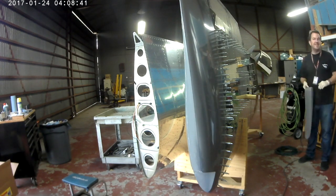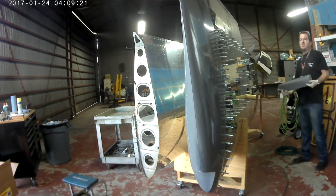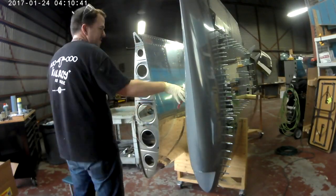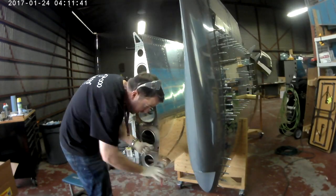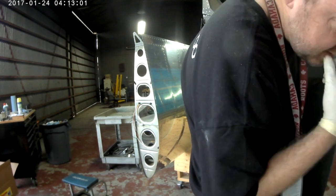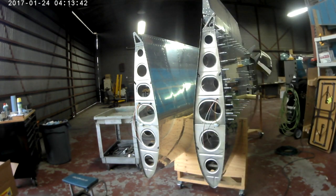So what you do is you make all these pilot holes. You've got a whole row of holes all along the outboard edges of the wings and the aluminum that you never really touch. It always says in every chapter: don't dimple, don't do anything here. And this is why — this is what they're for.